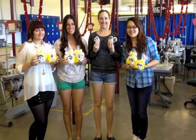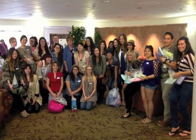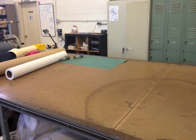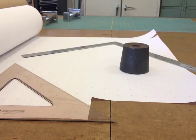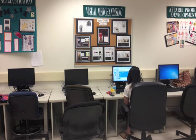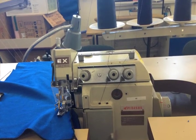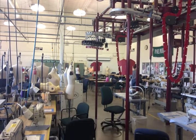What we learned. Throughout the course of AMM 381 Apparel Production, we learned firsthand about the steps necessary within mass production. We learned about time management, cut order planning, how to prepare different bundles before sewing, and inline quality control. We also honed skills we had covered in previous courses, such as creating tech packs with Adobe Illustrator and sewing 3-thread overlock and 301 single needle lock stitches on the machines available in the AMM production lab.